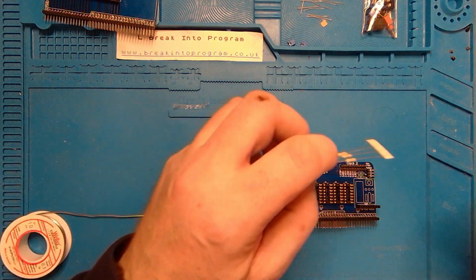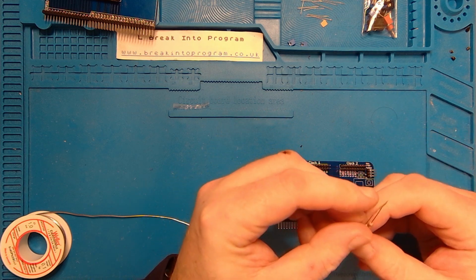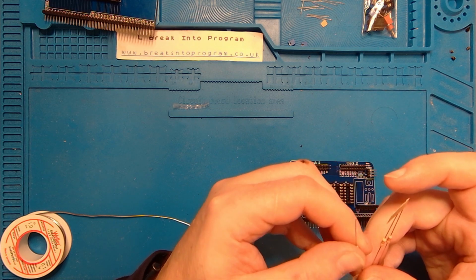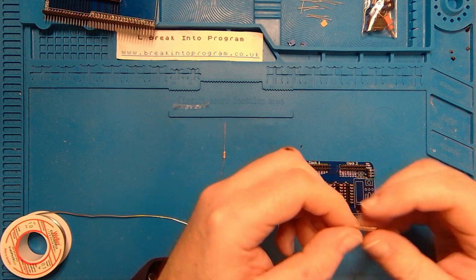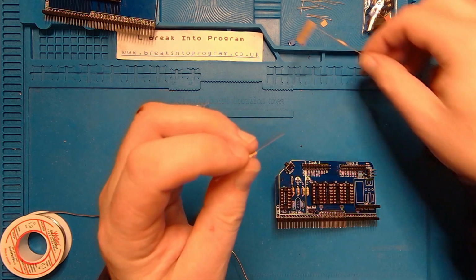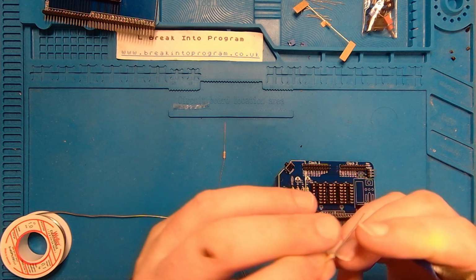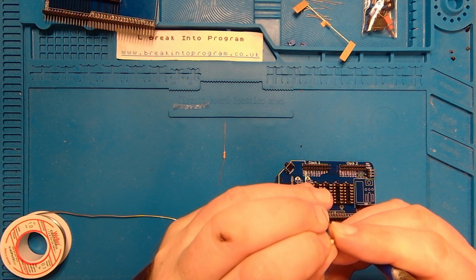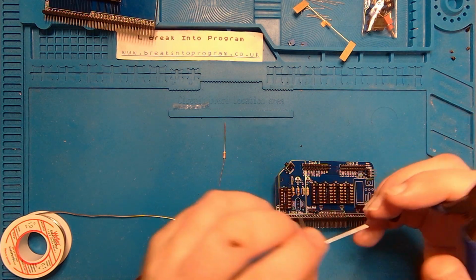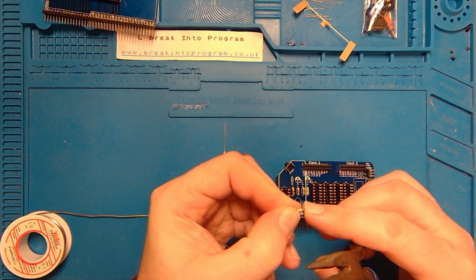Another tip is when you're forming resistors. I showed you in one of the early videos, I've got a plastic component forming tool. You can hand form, sometimes it looks a bit scruffy. You can actually use good old trusty needle nose pliers just to get a nice 90 degree bend really close to the component. They're quite tight fits on the board here. Not a lot of margin for error, so you just start it off and then bend it round.